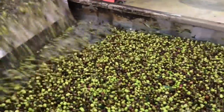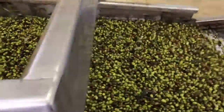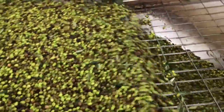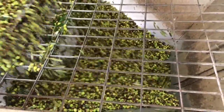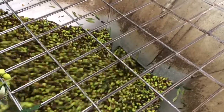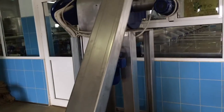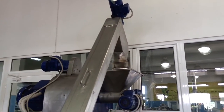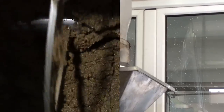As they move along, they are being cleaned, washed off, strained, and drained, then moved on to the next part of the process. They're raised again into another escalator where they're going to be pulverized or crushed as part of the main olive oil compression process. In the past, this was done with a couple of horses turning in a circle with a milling stone, grinding the olives and the olive oil running off the stone. In this case, this is a modernized version where the olives are brought into a mulcher and completely pulverized.